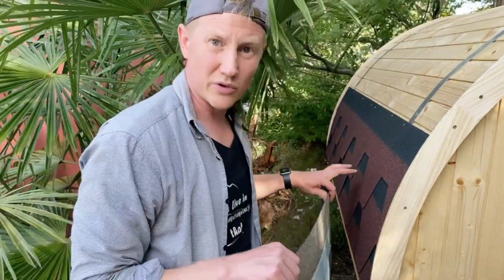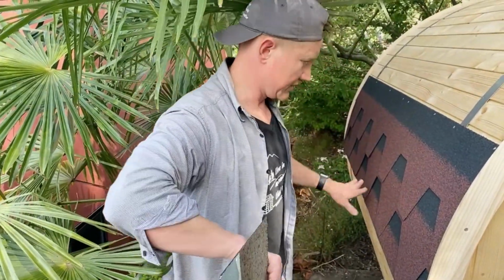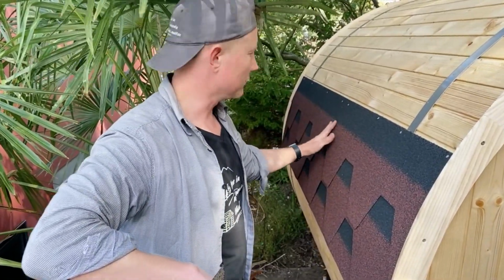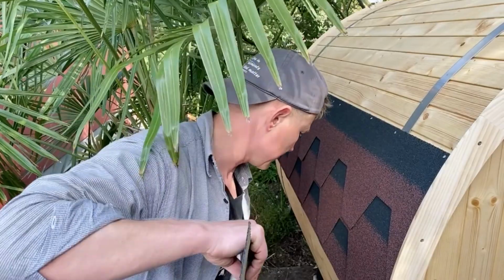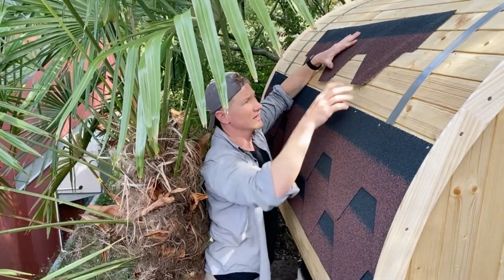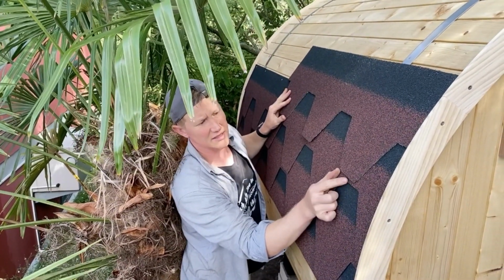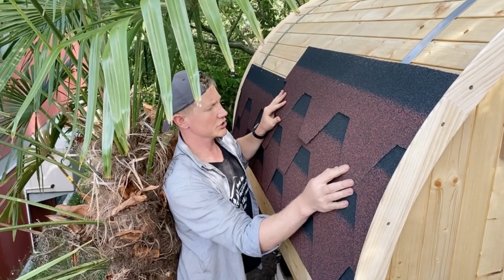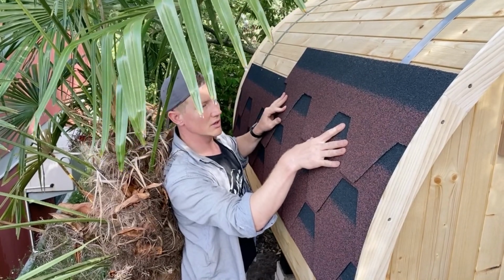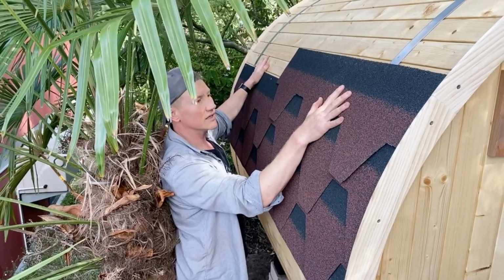So when you come to this point, you have a fairly good idea of how it all comes together. You're basically going in a zigzag fashion, and whether you decide to cut or not, you can overlap a little bit, and the next one up comes and overlaps the other side. So this one, we finished off here. Now the next one is coming here. Again, we're maintaining 10-15 mil of this edge, 10-15 mil of this edge, and we're covering this joint nicely. So that's the next one to go. Then the next one will need to be cut, and so forth.